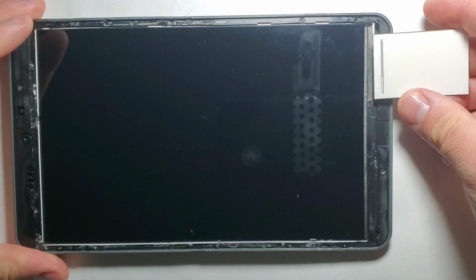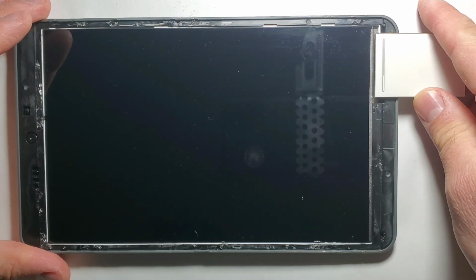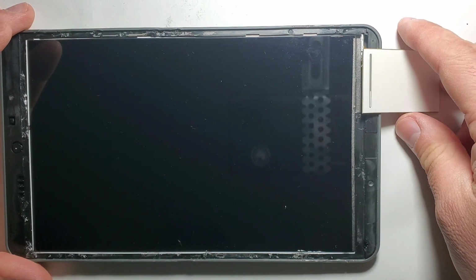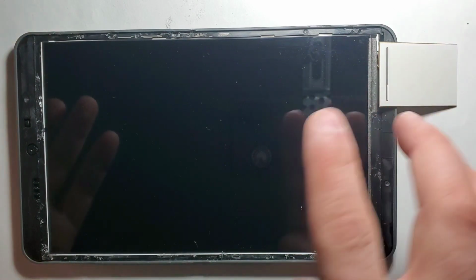With the touchpad removed, I will now take some measurements in order to make a sketch for the 3D design of the case in FreeCAD. By the way, it seems I will not be able to 3D print the entire case in one go, because the maximum size of my 3D printer is 20 centimeters by 20. So I will have to split the design in two.